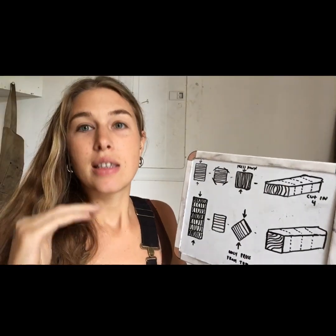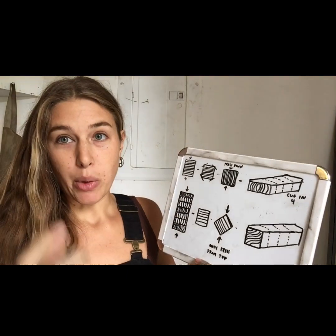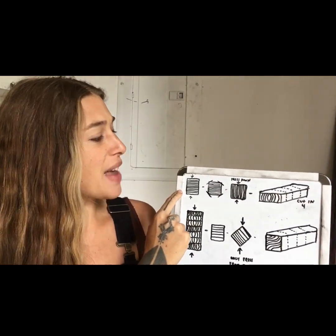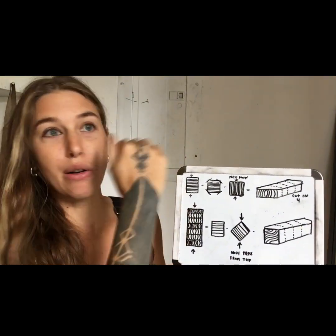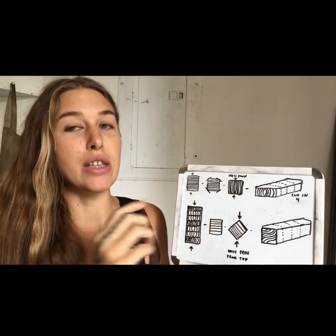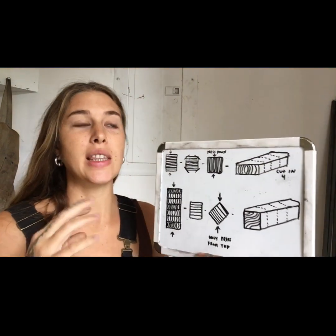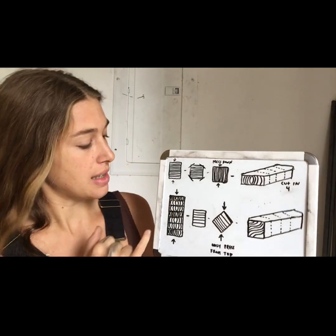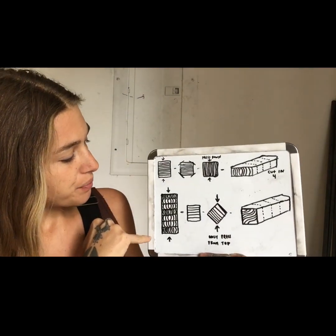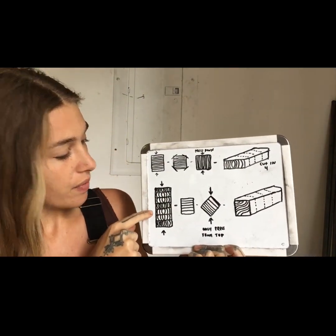That completes our single C pattern. But I wanted to create a double C. On your other billet, you're going to go back to this step, draw that out, restack it, four or five times, and then continue on. Now I have two separate billets — one is a double C, and the other is a regular single C. The double C is always going to be a little bit shorter, so in the end I cut it into three pieces, and then the single C into four pieces, for a total of seven pieces. The two ends are going to be the double C, one in the middle, and then the single C — four pieces right in the middle.